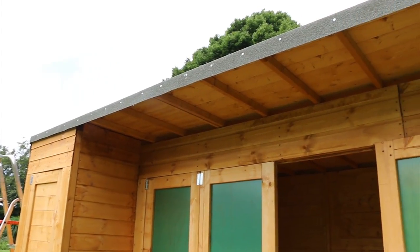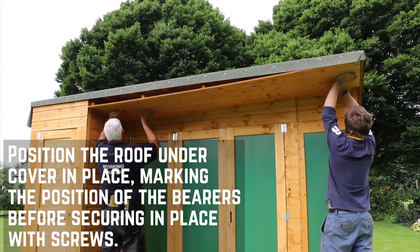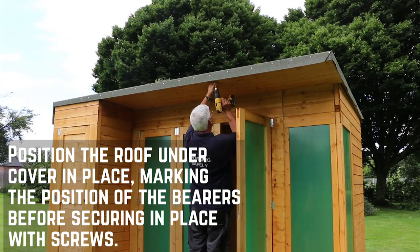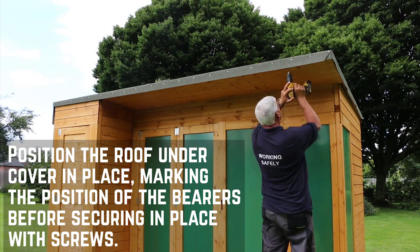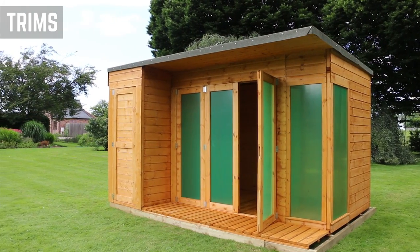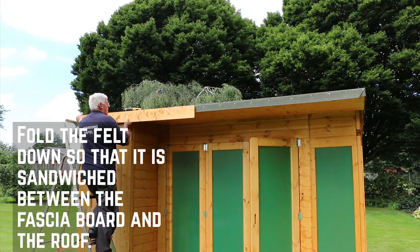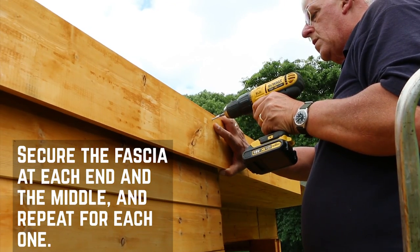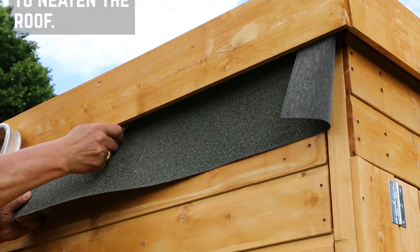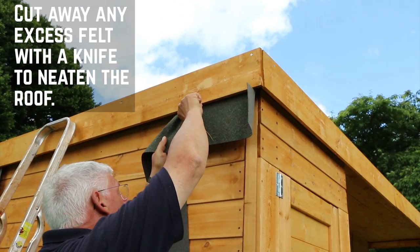You can now place the roof under cover in position. We found it easiest to position it in place and then mark it with a pencil to align the framing before securing with screws. With the roof felted it's time for the trims. Fold the felt down so that it's sandwiched firmly between the fascia and the edge of the roof. Secure these at each end and the middle and repeat for each fascia of the building. Don't worry if there is some excess felt under the fascia — this can simply be cut away with a sharp knife.